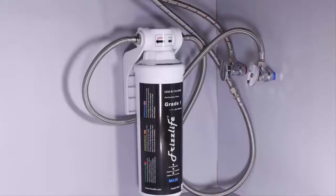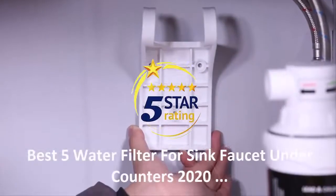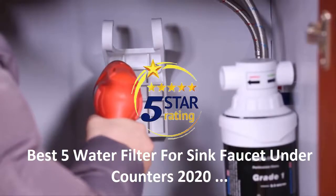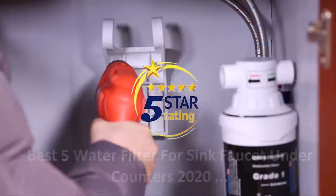The installation of Frizzlife MK99 water filter system is super easy. First, you need to take the bracket off from the filter system. Find the right place to mount the plastic bracket. Make sure it's at least 4 inches lower than the bottom of your basin. Use an electric screwdriver to fasten the screws.